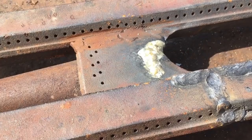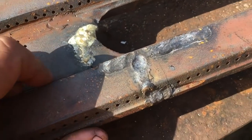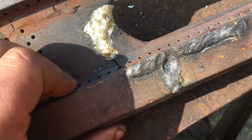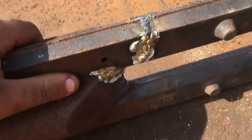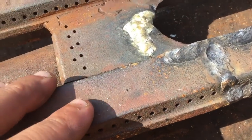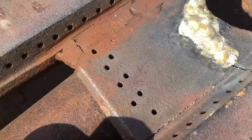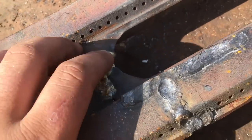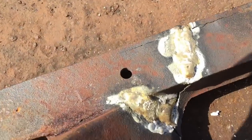Alright guys, so this is something cool I wanted to show y'all about the cast iron. This is actually the next day, but this will all be in the same footage. This is the next day of this piece. See all these extra cracks? Yesterday I decided to throw it on the ground about as hard as I could, because I wanted to see how the braze and this Nomacast rod and everything reacted to an instantaneous shock of me just throwing it smack on the ground about as hard as I could.